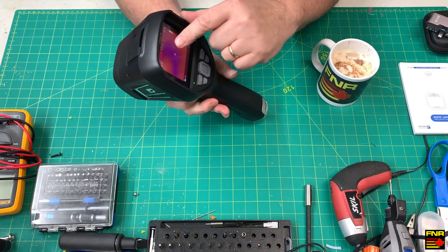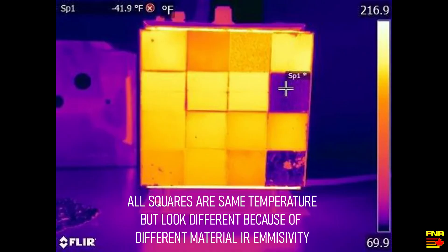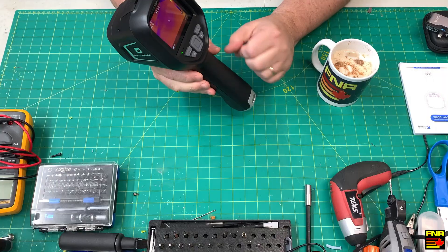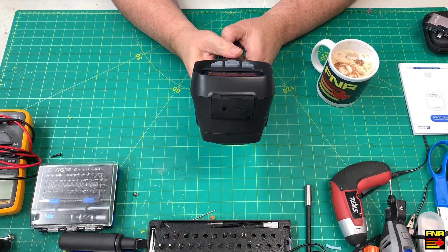If you are careful, you can even use the camera to take direct temperature readings off of something. This can get tricky because different materials give off different amounts of IR light at a given temperature, such that two materials at the same temperature might look different in the camera. This is called emissivity, and to get an accurate temperature reading, the camera must be calibrated with the correct emissivity value for the material you're looking at — and tuning that value can take some trial and error. But for 90% of the use cases for a thermal imager, the exact temperature and so the emissivity value don't matter. What you typically want is the gradient, and that will be visible no matter how accurate the emissivity value is.